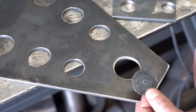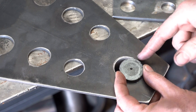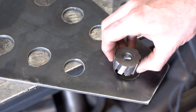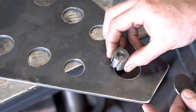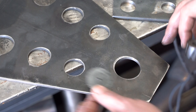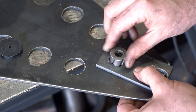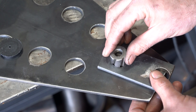Here's a quick fab tip. If you're familiar with hole saws, you'll know they need a small pilot hole to keep the hole saw centered. But what happens if you need to make a hole larger with a hole saw — you no longer have a pilot hole. In my case, I need to cut a smaller hole just off a larger hole and still can't use a pilot hole. What you can do instead: cut the hole you need in another piece of material, clamp it to your workpiece right where you need the cut, and that second piece will keep the hole saw centered and guided so you can cut just a tiny chunk without it wobbling all over the place.